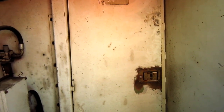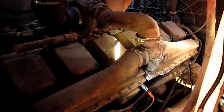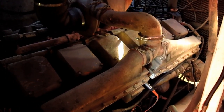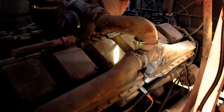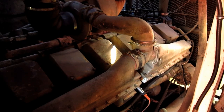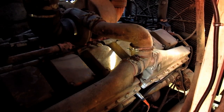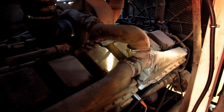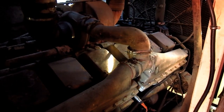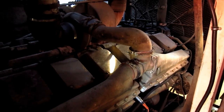Through this door is the engine room. The RH-200 is powered by twin Cummins KTA 38C V12 diesel engines, which work together to produce 2,100 horsepower for this machine. For customers who prefer an electric hydraulic machine, ONK offered the RH-200 with optional electric power, powered by a 1,600 kilowatt electric motor.